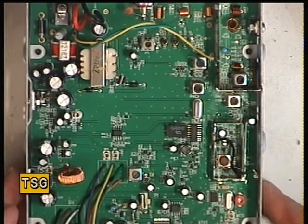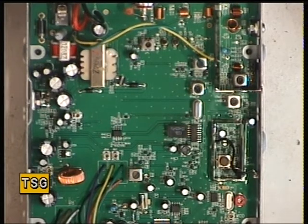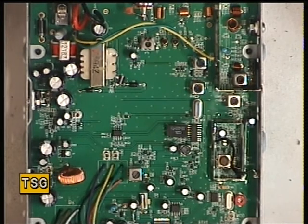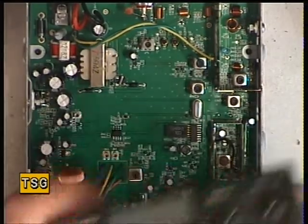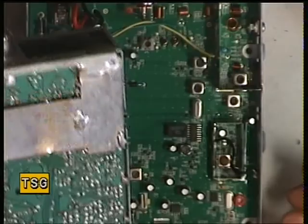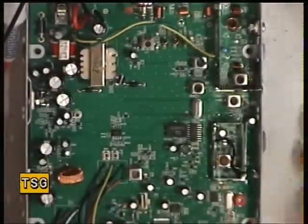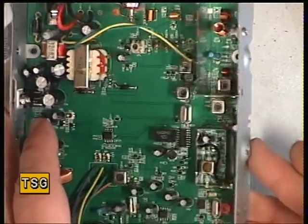The printed circuit board is fiberglass, which at least seems to be going in the right direction. Most of the ones these days seem to have gone that way. The SRBP — synthetic resin bonded paper printed circuits — which all CBs used to have, are really a consumer-only type of board and not really designed for much longevity. It is surprising that so many 30-year-old CBs are still working properly.